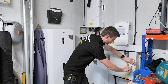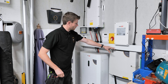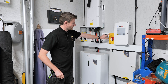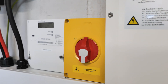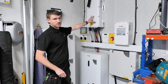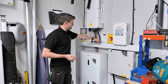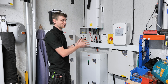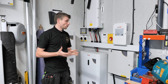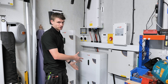Out of the solar PV circuit we come into our AC isolator, out of that AC isolator through this generation meter, and then from the generation meter into the inverter. This cable is feeding back to the distribution board to put all that solar power back into the property. If we want to grid-charge the batteries, that is also the route that power would take — so it's a bidirectional route of power.